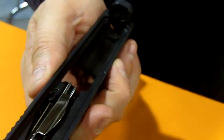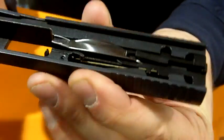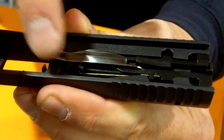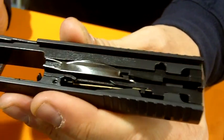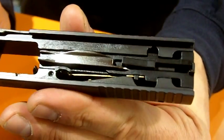Barrels are made in-house in Abu Dhabi, UAE, as well as every other item you've seen so far. Every item in total of the firearm is manufactured in Abu Dhabi. You'll notice, looks a little bit different. Our trigger mechanism is different than most, different than all, I should say. We have 3 internal safeties: firing pin safety, drop safety, and block safety.